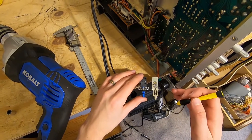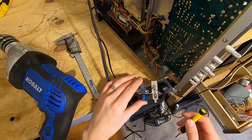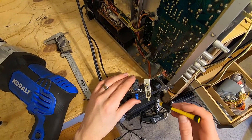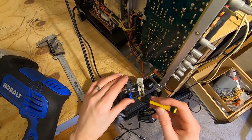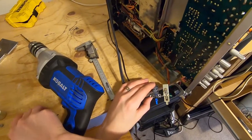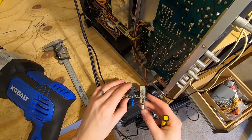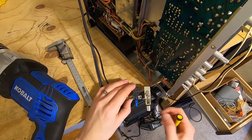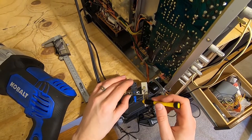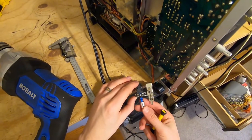So I overlooked something fairly serious. This is a switch I've used to replace power switches on Gen 1 models like a 2270 or 2230. These 2nd Gen models have a different switch. If you look at this surface here and this surface here, you'll see that they're different. That means when the power switch is on the new switch, it's going to sit very far inside the receiver compared to the old switch. So I'm going to need to find some material to put right in here to meet up at the line where the old switch lines up with the new one, and then I'll have to fill this with quite a bit of glue.